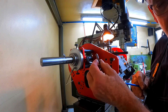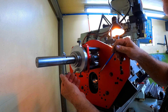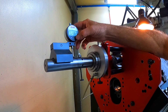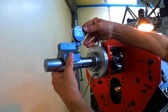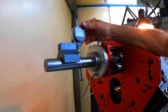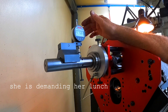Stick the tool in there, and then you have this little adjusting that goes in the bottom — it'll go against the tool. Tighten up the little set screws, and this fine adjustment will run the cutter up and down. Make sure it's all the way down, snug it up. We have our little digital indicator — get it set on there and zero it out. That's a number I've calculated for what height from here to here is, so it cuts the right size hole. Should leave me somewhere around a thousandths to actually hone out with the line hone once I get it bored.